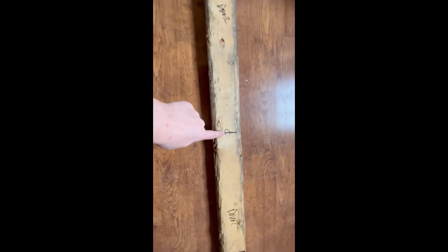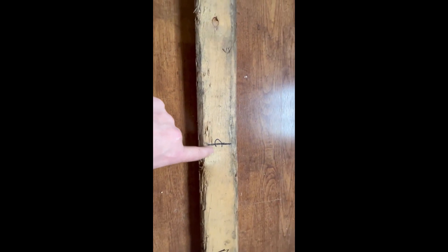Make sure to mark the center - you see these marks with the line of the C, you need the center of wherever you're trying to go. I'm doing a door centered right here, going with a 32-inch door, so I marked it at 32 centered off of that. What I want to do is lag this bottom plate to the concrete underneath.